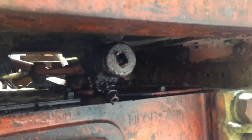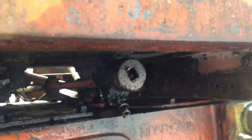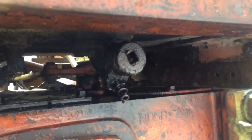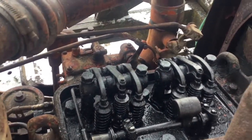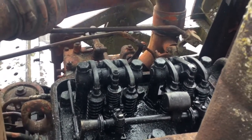Although I don't have it running again yet. I just put a battery in it, basically checked the rack was free, and it started up but quit in a couple minutes. Yesterday I started on it and I pulled the injector lines off — water came out of them, nice clear water. So that's when I figured it was water.